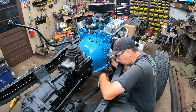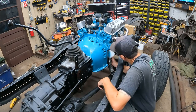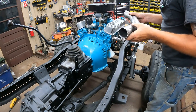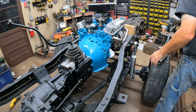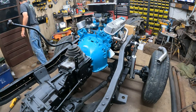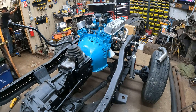I could put the converter low. Well, just a kick, but then I have to come out of it pretty tight, and I like to stay away from the drive shaft for articulation purposes. Get the welder out and tack her on. I've cleaned up the edge. I don't know if this is aluminized pipe or not, but the head pipes get so hot, you know, they don't usually rust away. Usually it's the back part of the exhaust system. So hopefully that will be okay to use, even if it's mild steel pipe. It won't rot off. It'll last for quite a while, even if it is.